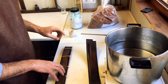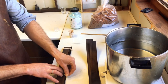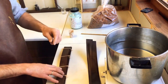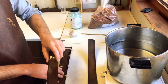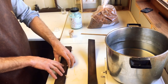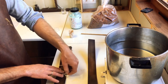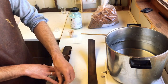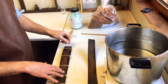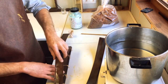While I leave my water to boil, I'm making a stack of the pear wood shavings and putting toothpicks in between. That's because if you put them in the boiling water without separation, they'll stick together and the color will be uneven — the places where they stick will be a lot lighter in color. Of course you could buy pre-stained pear wood, but the whole reason I like being a maker is doing all these things yourself — I just enjoy doing it.